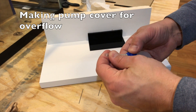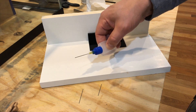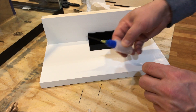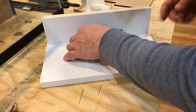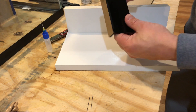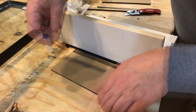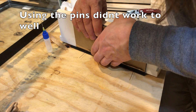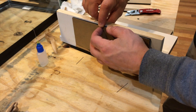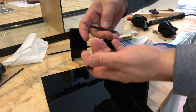With the applicator, you want to push the air out, then turn it over and use it. Because if you just turn it over it's going to pour out. By having that suction drawing it back, it keeps the solvent from rushing out. The solvent really does come rushing out of the bottle — you have to be very delicate with it. Acrylic is kind of an art. The pin idea didn't work out too well for me either. After one piece, I just put the two pieces of acrylic together and ran the solvent over the joint.